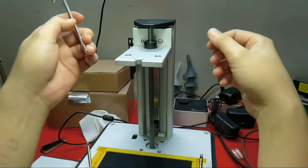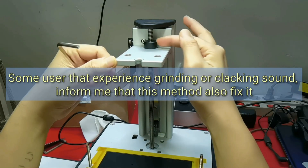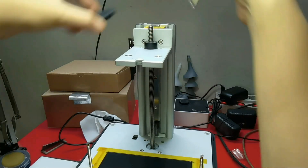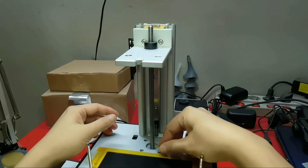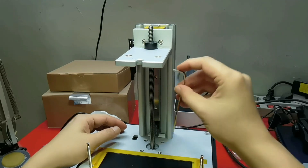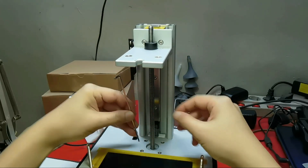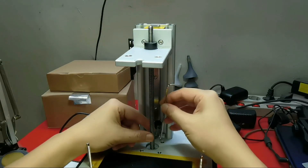The first way is probably just a case of a misaligned lead screw and backlash nut. So simply remove the top cover, and then loosen these four bolts — just loosen, do not remove the bolts — until the assembly can wiggle.